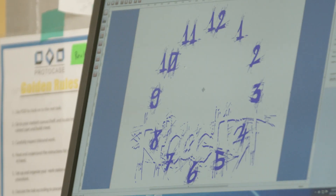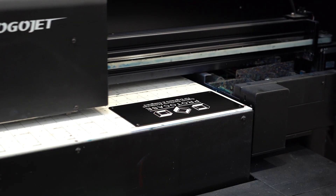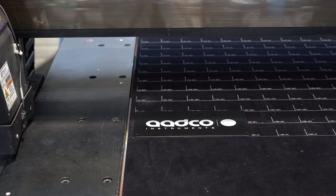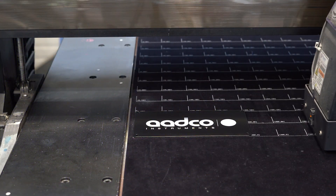First up, application process. Digital printing is done by blending densities of cyan, magenta, yellow, and black ink using industrial printers. As the UV printhead makes passes on the surface of the metal, the ink is then layered and instantly cured. This creates a linear texture that we call banding.